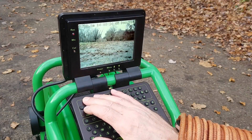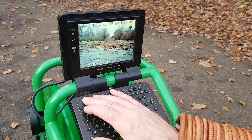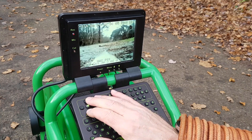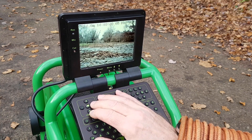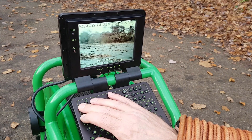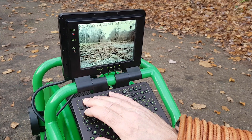I've come up against an obstruction here at about 213 metres out and we're losing traction. I'll stop the tractor by pressing the stop button, then go into reverse — mind the cable — and try to steer around the obstruction. Put the forward view camera back on by pressing forwards, then stop, use the turn keys, and try to get over the obstruction again by going full speed forward. We've got past it.